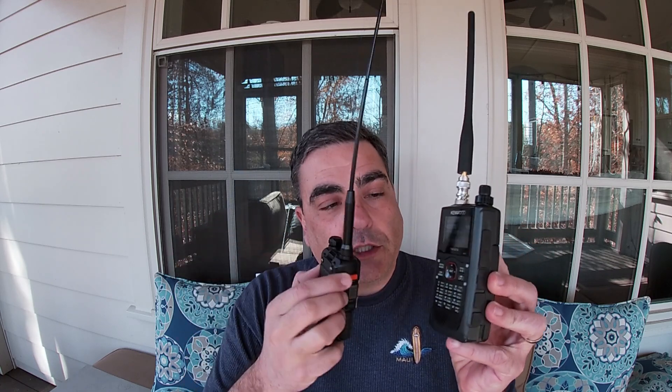But first, I want to talk about the elephant in the room. Last week I published a video where I tested this Baofeng UV-5R with a spectrum analyzer, and I found that it had out-of-specification spurious harmonics — meaning that according to FCC rules, I shouldn't be transmitting with this radio. The Kenwood THD-74 passed with no problem at all; very clean signal on transmit. So the $22 radio failed the spurious harmonic test; Kenwood passed. That's pretty high value and pretty important. I'm no longer going to be transmitting with this Baofeng.